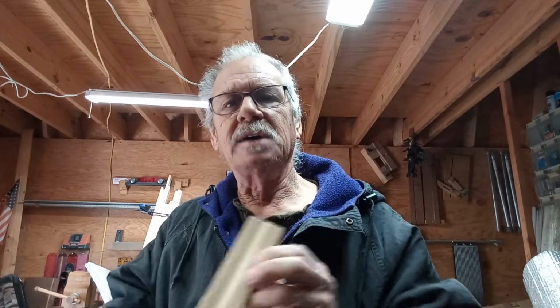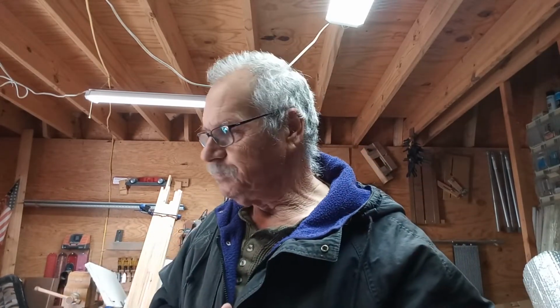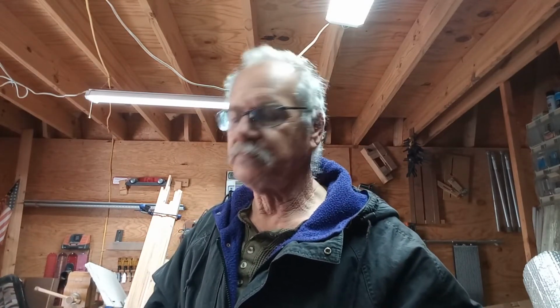It worked. Okay, so I can tell you, the molder is a very versatile piece. It's a little scary, but I think if you have the right zero clearance insert in there, which we'll get to, it won't be quite so scary. It'll be mostly covered up, no big gaps. I think that's what scares me the most, is that it looks like the wood could fall down inside there and go flying around. The knives, I'm not so worried about anymore. They're solid in there. They ain't coming out. And of course, the molder head's not coming out. So that's the only scary part now, is the opening.